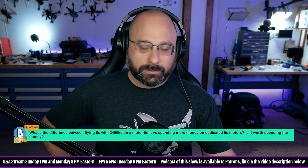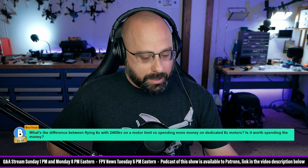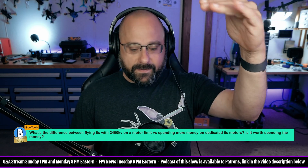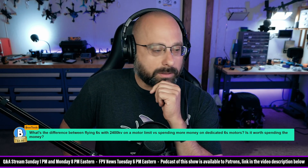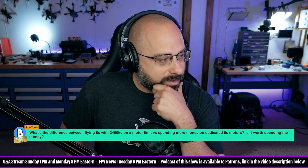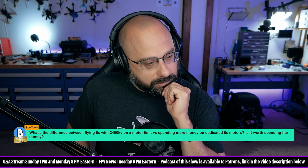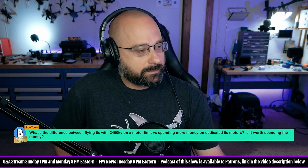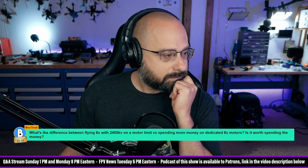The differences are subtle, and I feel not entirely qualified to talk about them. What you're doing is taking a higher voltage and using PWM to average it down to a lower voltage, which is not quite the same as just having a lower voltage. I think you are more likely to get desyncs. But Siati did that for about a year and said it was great, so you could probably get away with it.